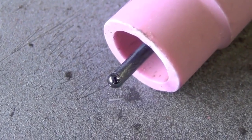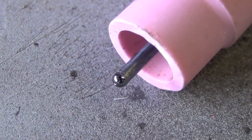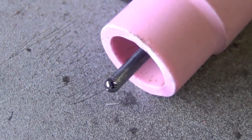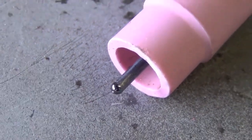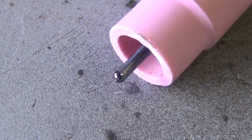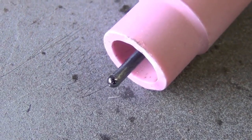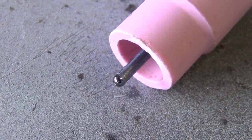There's the balled electrode - the ball itself is just over one electrode diameter. When you do this, make sure it's absolutely perpendicular above the plate, otherwise it's going to ball to one side. What you use to ball the tungsten is up to you - in school we used a half-inch thick scrap aluminum plate, in high school we used the steel table, and some people use a copper penny. I generally use a scrap piece of whatever aluminum I'm working with.